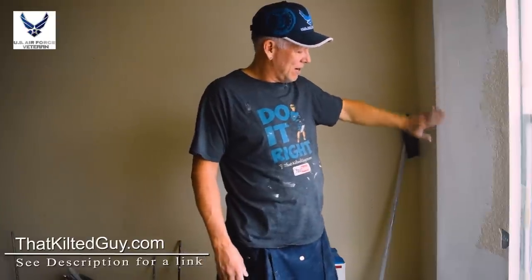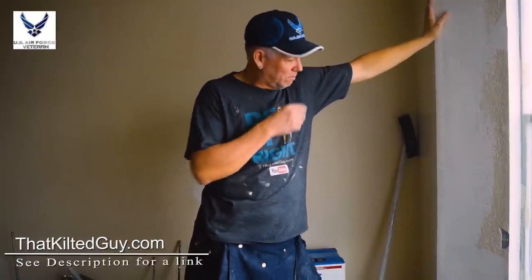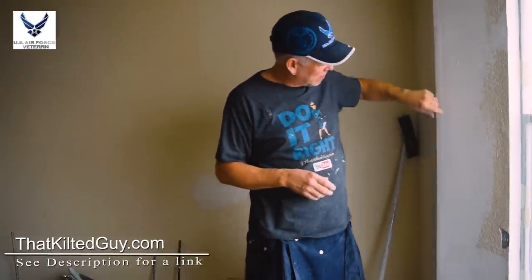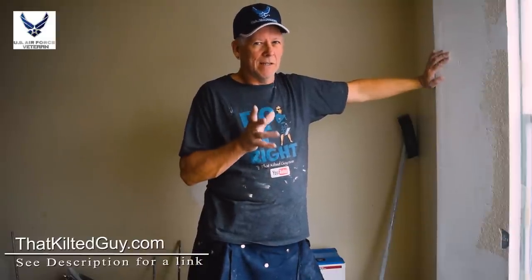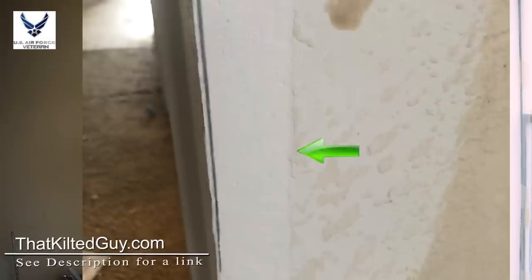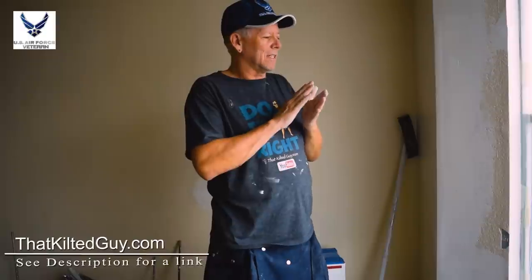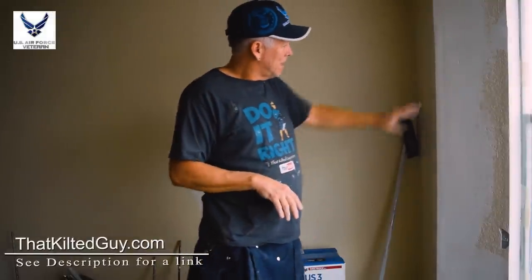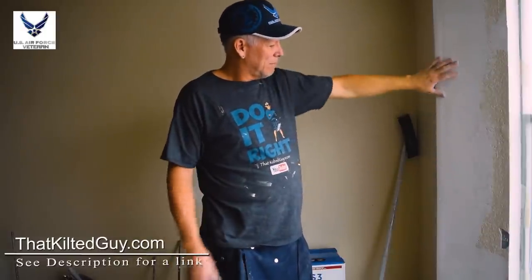Now, if you decide to just coat it without tape — is that totally wrong? No, I've done it that way many times and never had a problem. It's kind of going back to the way it was brand new, except that little line where it broke is a weak spot, so using tape is the better way. But if you do just coat it, here's the key: you can see the edge showing through — that edge will telegraph back through the texture. You've got to get it coated thick enough so that edge just disappears. If there's about a 32nd to 64th of an inch on there and it's sanded flat, it's not going to show.